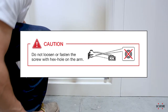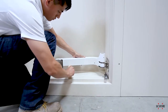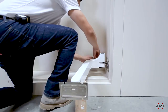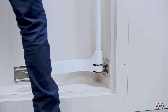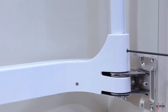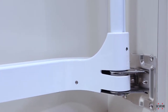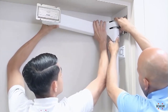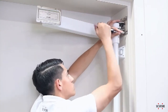Do not loosen or tighten any screws at this point. Gently place the arm mounting plate over the screws on the cabinet frame. Using a 2-inch block to support the hinge arm, install the top screws on both sides of the arm mounting plate. Tighten all upper screws. Place the connecting bar into the socket of the arm, aligning the connecting bar channel to the socket on the arm. Use the 4-millimeter hex wrench to tighten the bar in place. Fasten the hex screw by hand, not to exceed 80 inch-pounds of torque. This is to prevent a gap from opening between the door and the door frame. We recommend two people to gently mount the upper arm over the two screws and place the connecting bar into the socket of the arm. Once the upper arm has been set in place, tighten the screws for the upper arm mounting plate.